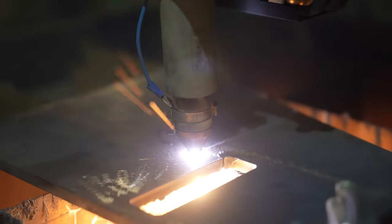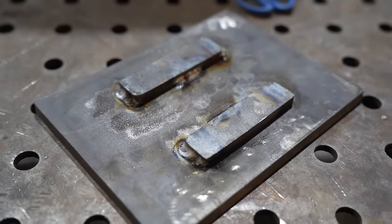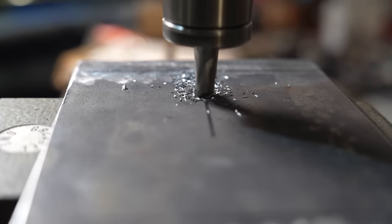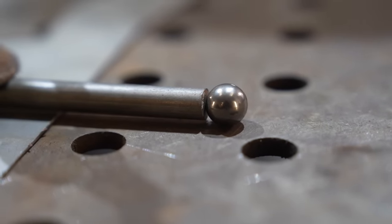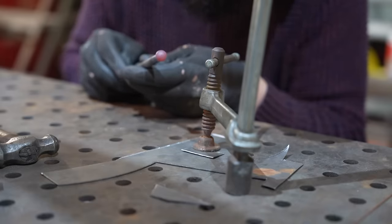I've got a 10mm sheet of steel, put it in the plasma cutter, cut out a rectangle and two extra strips. Welded the strips onto the back - those two strips give me somewhere for the jaws of the vice to clamp it. Then I've bought a sort of ball nose or rounded nose end milling cutter, slightly larger than the pressing. That will give me a little half pipe, a valley basically, and I can munch that across and then 90 degrees go back to the right size. Then I've got some ball bearings - these are steel and they're weldable. They are slightly smaller than the valley. I'm going to weld that onto a stick of steel and make essentially a hammer with a rounded end that's just the right shape.